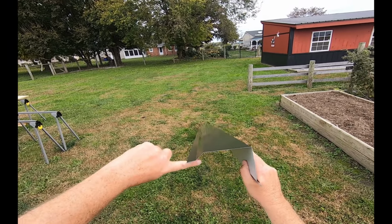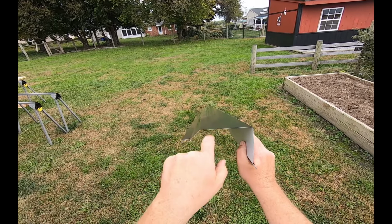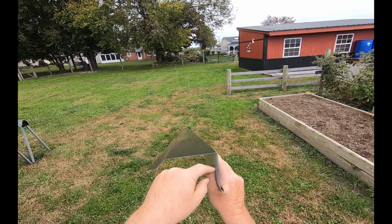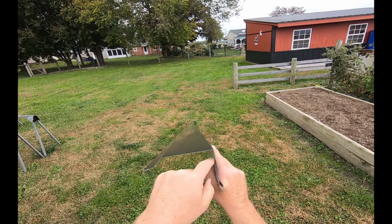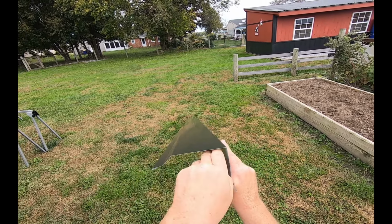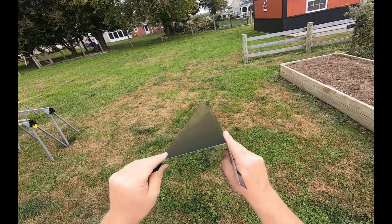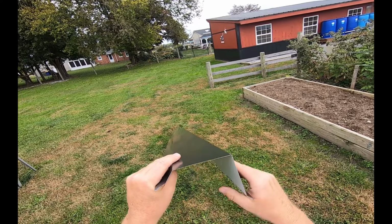This goes flat against your roof. You have 3/4 of an inch. That's for this type of roofing anyways. The ribs are 3/4 inch tall. So you have 3/4 of an inch that you want something supporting back in here. So the rib supports that. And you'll see that when I go ahead and install one of these. The rib's going to support this end so that you have a nice constant flow with your gable trim, so it's not up and down. See, you could move this like this without something supporting it.